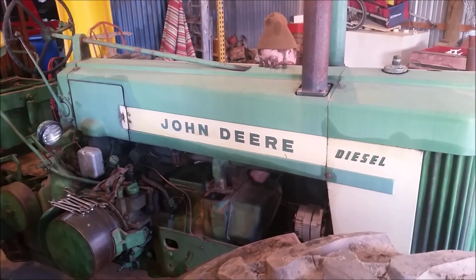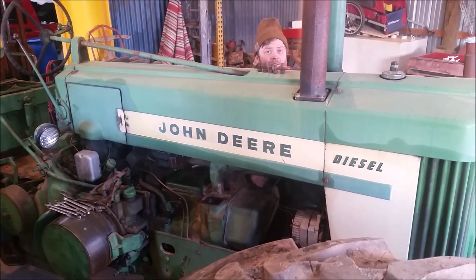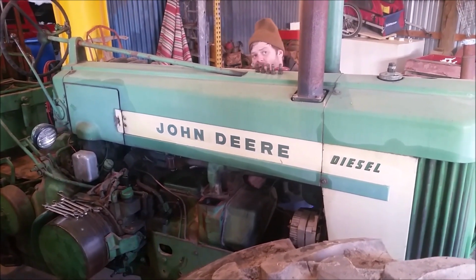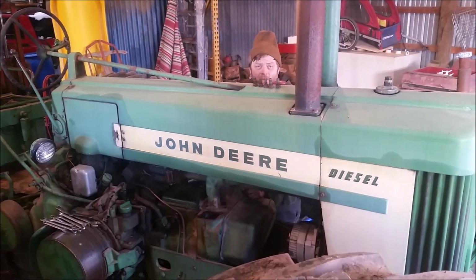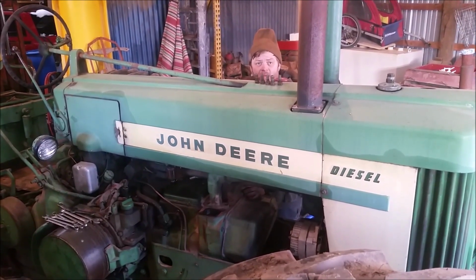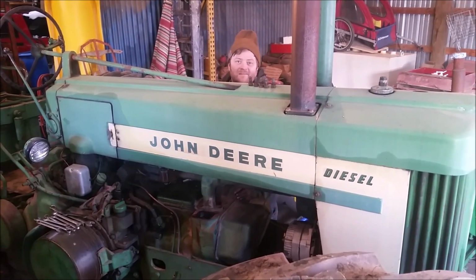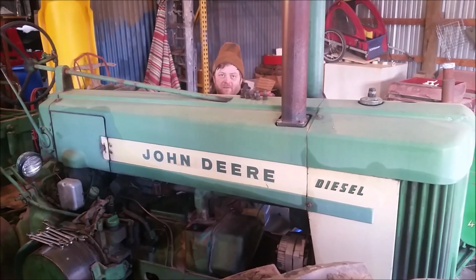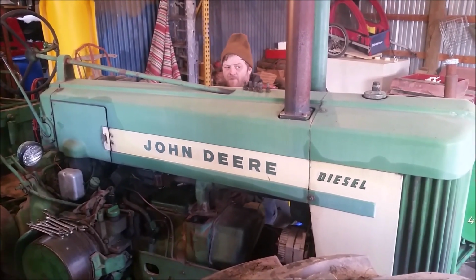And it keeps going. Grandpa had one, a 730, like in the 60s. And it would blow a head gasket every year. And then he just kept doing it. And then finally they found a problem that kept getting missed in the head. He put a newer used head on it and it never did it again. So how much is the head gasket kit and what does the head cost? A used head is a few hundred.